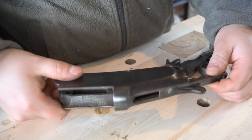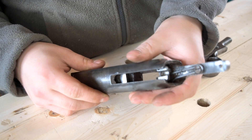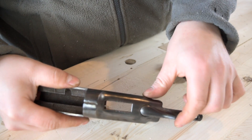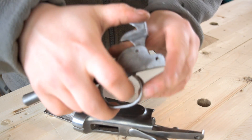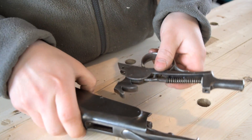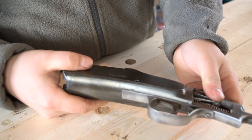Here we go — let's start the reassembly. That beautiful action is all cleaned up. This assembly was really sticky and grimy, and I completely disassembled it from the inside — all the locking lever system. Cut out all the grime and grease, removed the rust, packed some hard grease in there, cleaned up the spring so it slides nicely, and it just runs beautifully. Cleaned up all the trigger assembly, the spring, the shaft so everything slides a lot nicer. This hammer was almost a two-handed job to pull back before, and now it's really nice the way it should be. Everything's oiled. Look at how that snaps together — gets me every time.